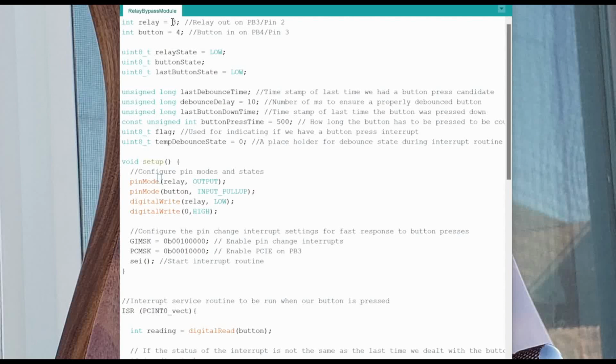That's the thing, you have to keep track of what your Arduino package wants to see. We're using the really common ATtiny package, which I will talk more about once we get through all the code, and it wants to know what the port B pin number is for our assignment. It doesn't care what the physical pin of the package is. It wants to know what the pin is that the hardware architecture sees. Okay? It has to do with how it handles all the registers internally.